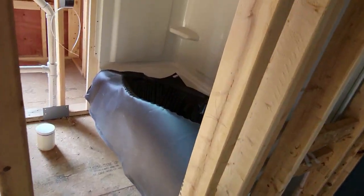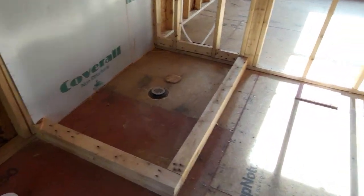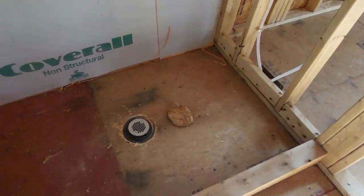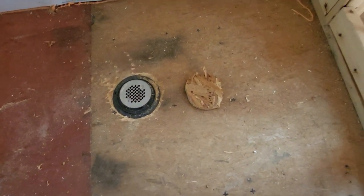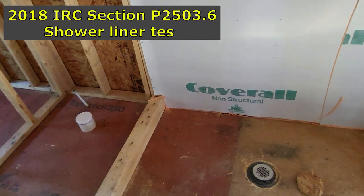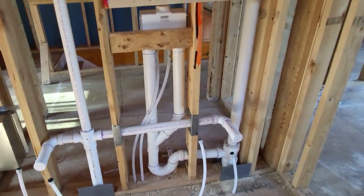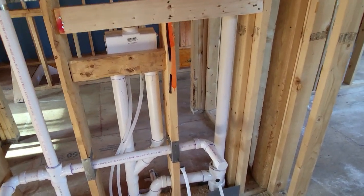In the code book there's a shower pan liner test that should be conducted with all showers. Typically they'll throw a rubber liner in here and test for any leaks. That should be included in the pressure drainage test as well. You want to make sure before that drywall goes up that everything has been tested and is watertight with no leaks.